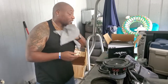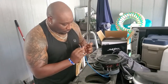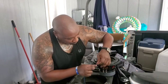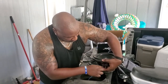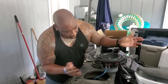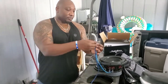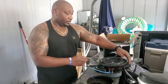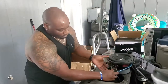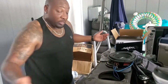Really easy to get this done. I have denoted my striped wire as my hot, and I'm going to come in here, make sure it's twisted and small, go in here like so, then put the black in there — good to go. So I take from the box lead, combine it to this coil lead here, and run it to the other side, with my hot over here and my negative over here, and effectively you're done.